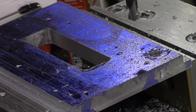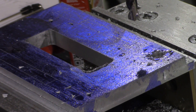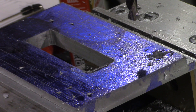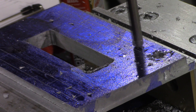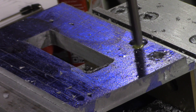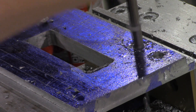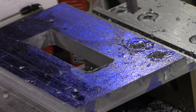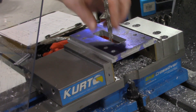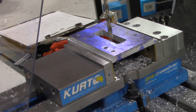There's the start of one slot, and the end of it is at 1.75 inches. I use my digital readout to get me to 1.75. The drill bit's a little bit smaller, so I'm happy with that — I'll go ahead and get this hole drilled. I really like seeing those layout lines ahead of time. I'm just going to repeat that for all four slots. We've gone ahead and drilled the beginning and end of each slot, and this drill bit is about a sixteenth of an inch smaller than the actual slot we're planning to make.